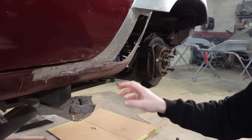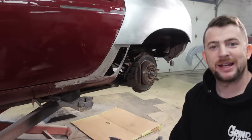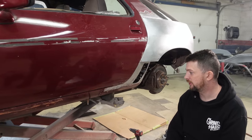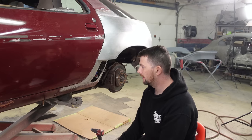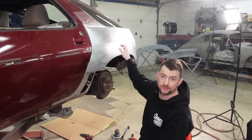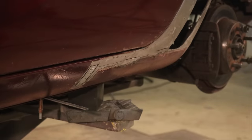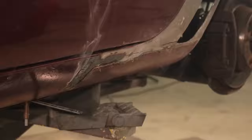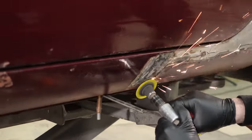What I'm going to do is weld this back shut. This will stay cut back here — I'll peel that out, butt weld here, add some structure underneath to tie it in. But forward it's going to have to be lapped, which as many of you know I hate. There's no other way to do it — structure is always lapped, period. We'll do the best we can to get a nice fuse on the top edge, then it'll get epoxy, tons of cavity wax on the back side, and some fiber-reinforced filler.